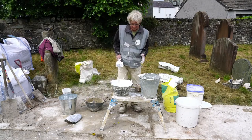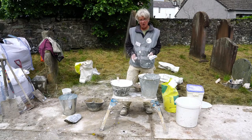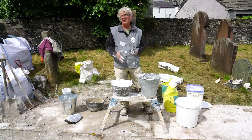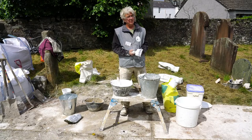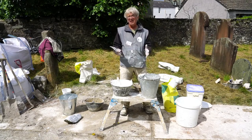So would aggregates be in there from the beginning if you were doing it with aggregates? As a shelter coat, no, I'd put them in about halfway through. Yeah, and keep mixing, like I just did. Sorry? Would you put aggregates in the grout? Not necessarily, they didn't typically. It's hot lime grout they're talking about. It sounds madness because you think, is that going to carbonate?